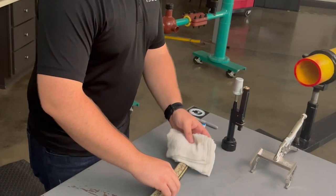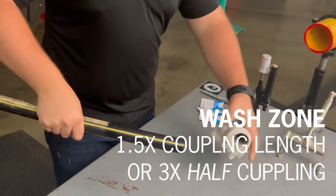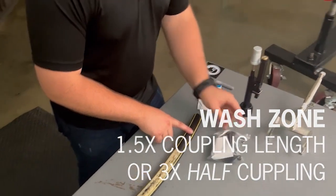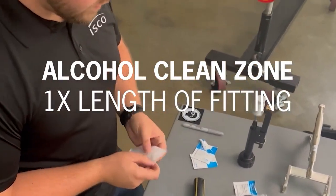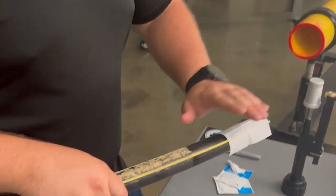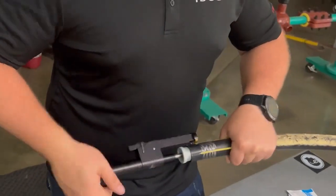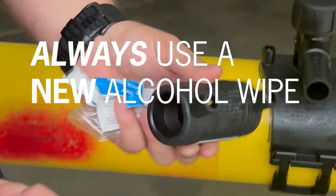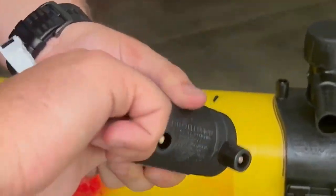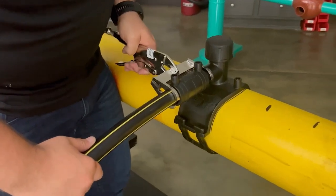Now prepare the pipe to be fused to the outlet. Using a damp cloth, remove any loose contaminants from the pipe. The water washed area should be one and a half times the total coupling length, or three times half the coupling length. Next, use an alcohol wipe to clean the pipe within the water wash area — one time the length of the fitting from the end of the pipe. Using your peeling tool, remove at least seven thousandths of pipe surface material from the service line. After peeling, clean the peeled area with an alcohol wipe. Remove your coupling from the package and clean inside both fusion areas with another new alcohol wipe. Make sure all the alcohol has evaporated before continuing. When ready, stab the tap tee end and pipe end together inside the coupling and apply a clamping tool. The joint is now ready to fuse.